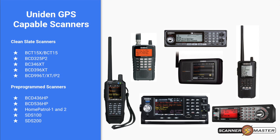If you're using the full database on any of these pre-programmed radios, you'll have latitude and longitude in the background. And if you're creating a favorites list from this database, you'll also have latitude and longitude. One important thing to keep in mind: whether using a clean slate or pre-programmed scanner, you must have the programming enabled for GPS scanning. If you don't enable that, it will not do GPS scanning.